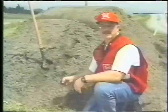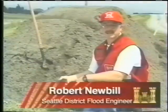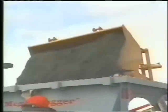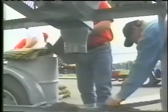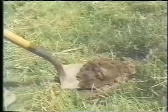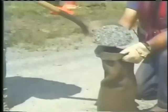Sand is the best soil to use in the bags because it shapes so well, and when the sand is in the bags, they can pack together to keep the flood water out. Although a sandy soil is the most desirable for filling sandbags, any other available materials such as silt, clay, gravels, or a mixture of these may be used when necessary, or if they are the only ones available.